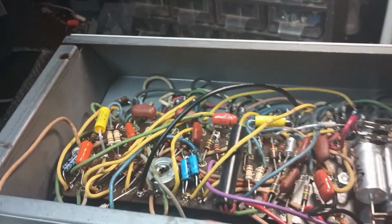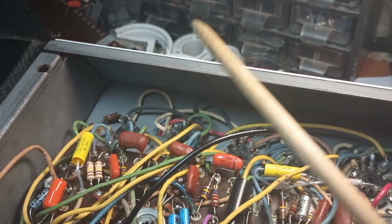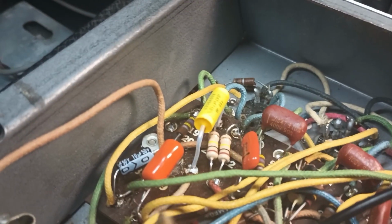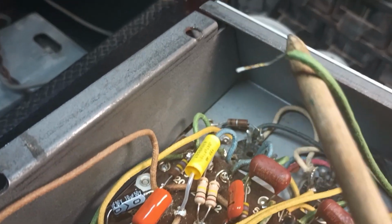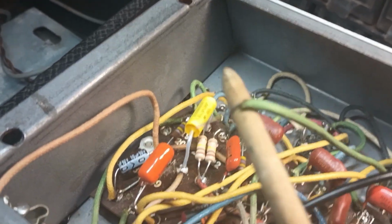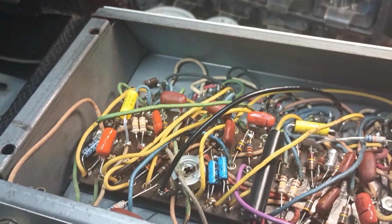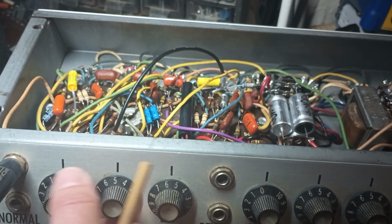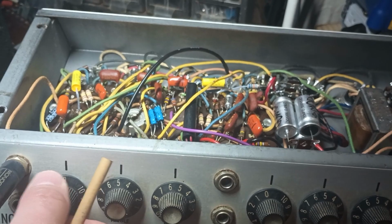All right, so we got this shielded wire in, and it's no longer microphonic when I tap it. But while I was tapping it, I think I found our problem, which is right here. Oh, there's your problem right there. That's why this thing was acting like an antenna. We forgot to put this guy back in his hole. Got to put him back home. All right, that should help. Let me do that. Well, that's a little better. Wrong knob. Ooh, she's a beast.